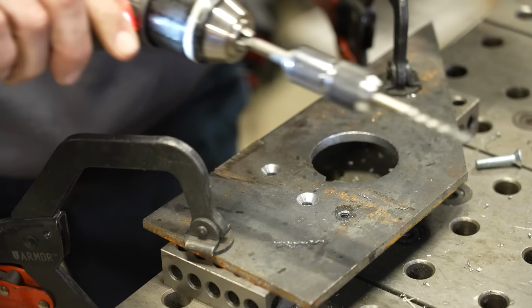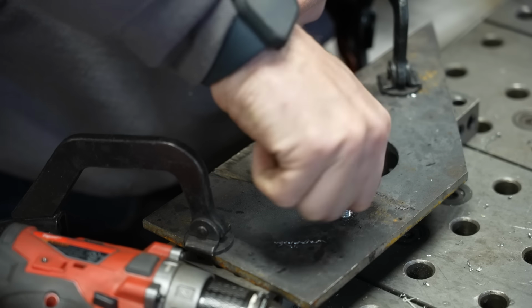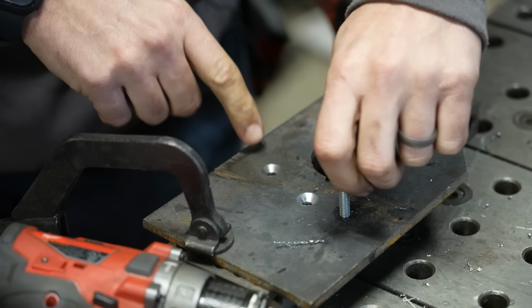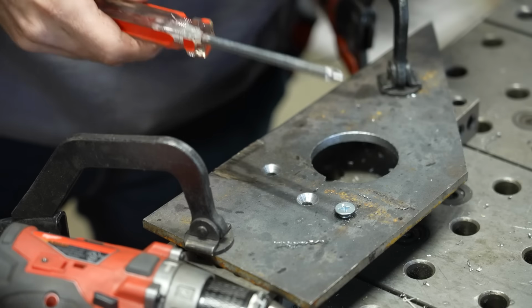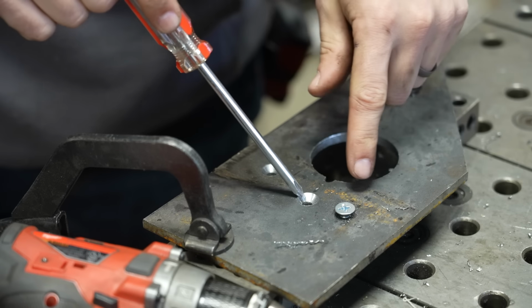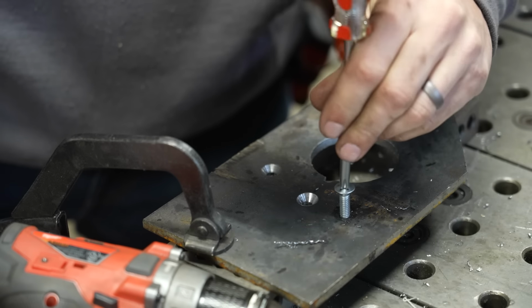And just like that, I've got a quarter-20 tapped hole inside this piece of quarter inch plate. You can see there's a quarter-20 piece of hardware. This is the same piece of hardware that we were using when I did the countersink demonstration. Now I wouldn't be able to countersink and tap this in the same piece. You would never do that anyway, but there isn't enough material in this thickness to get that. But anyway, you can see how nicely those threads got cut.